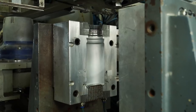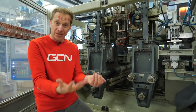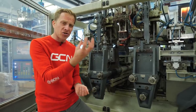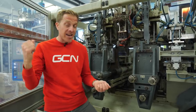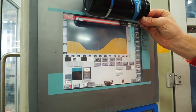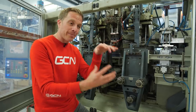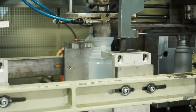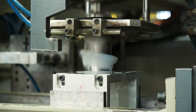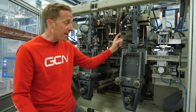At this point the mold also determines the various thicknesses of the bottle — the sides, the base, and the top. You want a solid base so it doesn't collapse under its own weight, and a strong neck so the lid stays in place. The screen shows you the different thicknesses of all those parts. Once blow-molded, it moves along to the tooling phase, making sure there are no rough edges and that the threads are nice and precise.